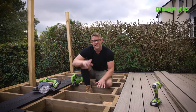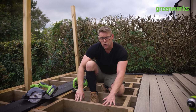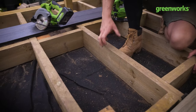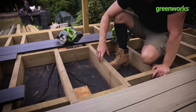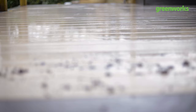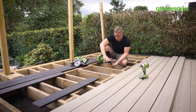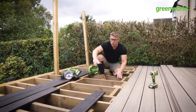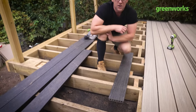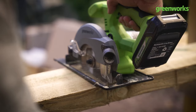The subframe timber itself — it's essential that you use something like a tanalised or treated subframe timber. In this case we're using six by two tanalised treated timbers — this is actually Douglas fir, which has its own integral properties resistant against weather here in the UK with a lot of moisture in the winter months. We want to make sure whatever timber we put down withstands the elements as much as possible. We also want to make sure water isn't holding against the subframe, so there needs to be a gap underneath all the timbers — we don't want any of our joists sitting constantly in moisture because that's only going to start the decay. A minimum timber size I would suggest, if you can get it into the space, is six by two.